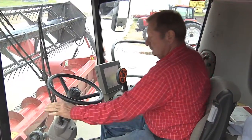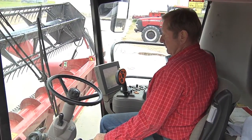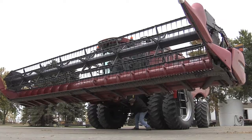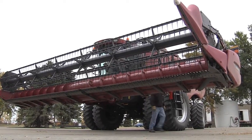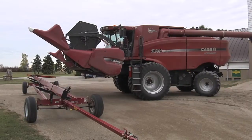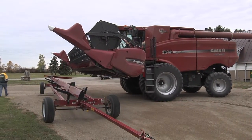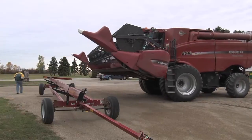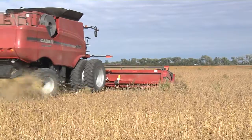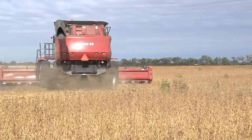Use the combine horn to signal moving away. Since combines are such large machines, it can be difficult for the operator to see people on the ground. Individuals who are required to work in areas where combines are moving need to be instructed in combine safety practices as well as the operators. Avoid making sharp turns, and be particularly careful when turning on slopes and uneven ground.